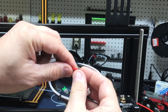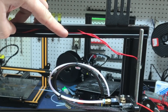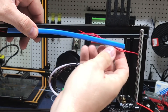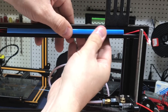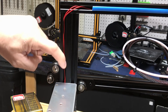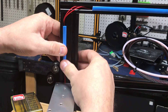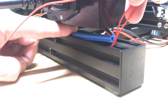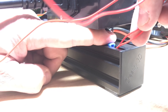Now I need to route this wire through the channel at the back of the printer. I'll put it right inside the channel and use this plastic insert — I borrowed it from another printer — it snaps right in and holds the wire. You can also 3D print something to go in here; there are lots of options on Thingiverse. Then I'll bring it down the upright near the power supply, on the channel that doesn't have power supply screws going through it, then behind and underneath the power supply all the way to the back of the printer.